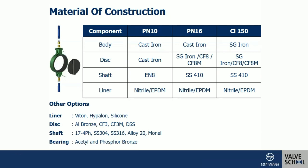The disc material follows a similar pattern: cast iron, SG iron, then stainless steel. Unlike other valves, the butterfly valve disc — the closure member — is always exposed to the line fluid, so corrosion protection is necessary. Even with cast iron, bare material is not advisable as it corrodes easily. A nylon coating — encapsulation — is applied on cast iron and SG iron discs. A bare disc is used only if stainless steel, which has an inherent chromium oxide passive layer providing corrosion resistance.